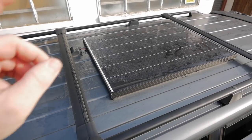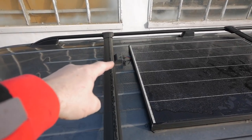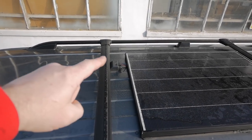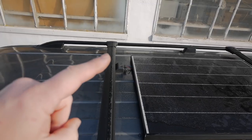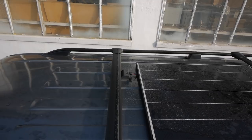Right, we'll have a quick look at what we've got here. I'm not going to go into too much detail because I went through the whole system in the last video — I'll try and put a link up to that one. So up here is a 150 watt solar panel, and there's the entry point for the cables. I've got to fit another one of those. I'm going to fit it here to make it symmetrical. The reason I'm not putting two sets of cables through the same hole is because you'll get water ingress — you need one perfectly round cable going through so it can tighten up onto the seal.